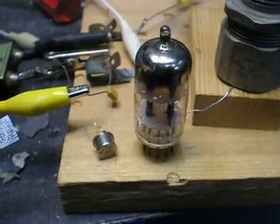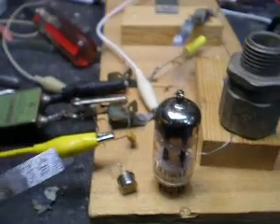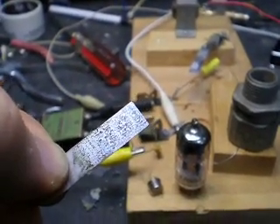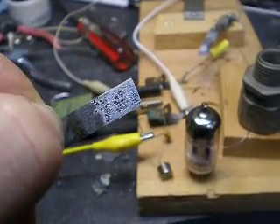But I'm going to show you an oscillator that's actually a working radio transmitter that uses a different sort of device. One of these. This is a strip of sheet metal that's been heat treated to create areas of negative resistance.